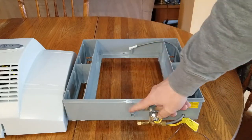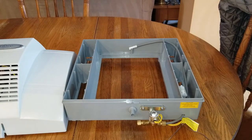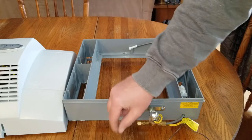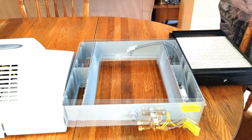Either it'll be hard piped in PVC, or you'll have vinyl tube, or both. I usually like running vinyl tube stubbed into a secured PVC drain myself, but sometimes they'll just run a long piece of vinyl tube and strap or tape it to the duct and run it to a floor drain somewhere.